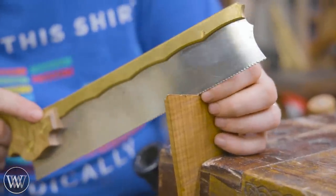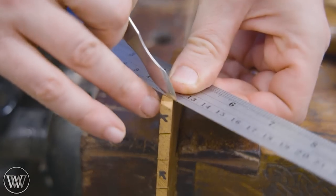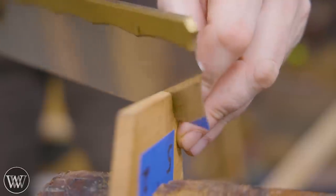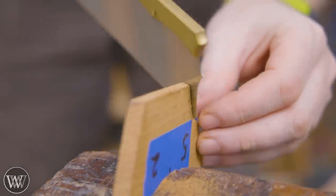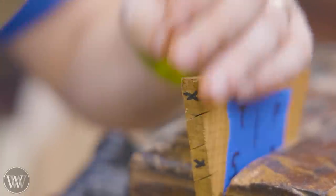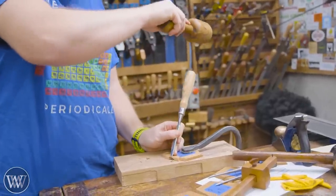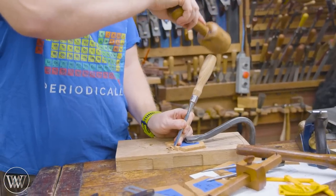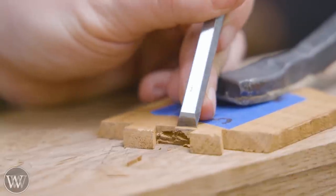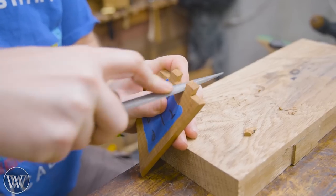This is my seventh attempt and one thing I learned is I have a pattern maker's vise. Anytime you're doing weird, wonderful angles, a pattern maker's vise is fantastic. I didn't get that to click in my brain until about halfway through this one, and you'll see me switch from my regular end vise to the pattern maker's vise because it made this so much easier. For the dovetails, it's basically the same as anything else: mark them out, cut them down, remove the waste. With this weird angle, you start on the acute side up and punch it down at 90 degrees rather than following the bevel angle. Then flip it over and match those bevels, taking it back until I touch the very point at the bottom.